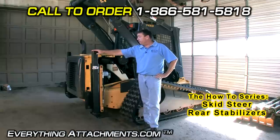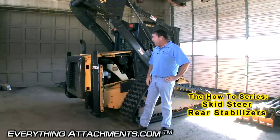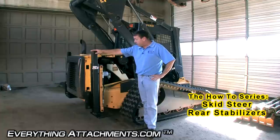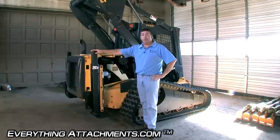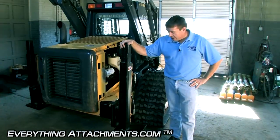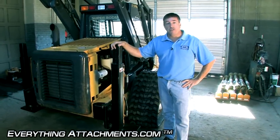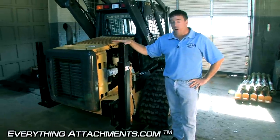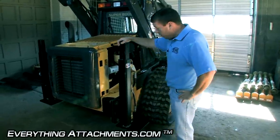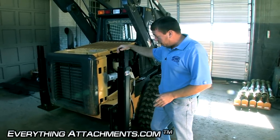But they were primarily designed for using a hydraulic tree spade — you've about got to have them to use them. We're going to show you why these are the best stabilizers and how we've plumbed them up and what you're going to do to install these on your machine. The Construction Attachments stabilizers are really designed to be super heavy duty, but they've also designed just some dead weight in them because part of what you need on the back of the machine is weight when you're carrying your tree balls once you've dug them, which can weigh almost half the weight of the machine.